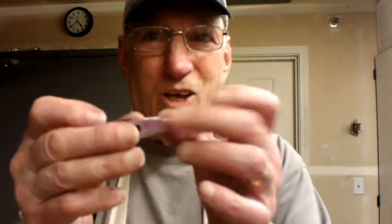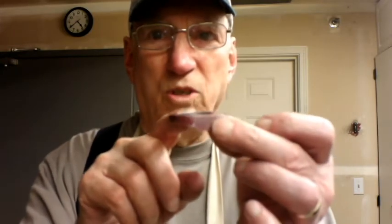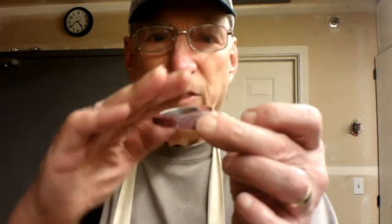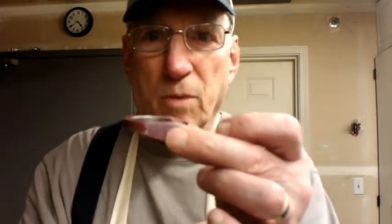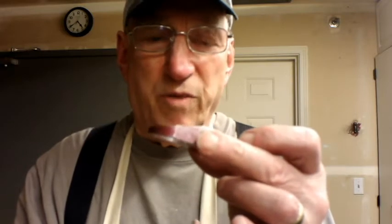So, I'm glad you watched, and what we'll be doing now, I'm going to move on to the next process. This part here is what I use for a sample part. I check a lot of things against this particular part, so I've got drawings and numbers and stuff, but a lot of setups, it's really easier just to have a part to set them to. So all my parts come out looking like this one, size-wise. Now what I'm going to do on the next operation is this taper that goes on this side here. This part gets set up kind of on an angle like that, and then I'll machine it off, do a taper, which is about a 15-degree taper. So that's the next operation that I'll be doing, and I'll try to capture that on the CD or video as well.